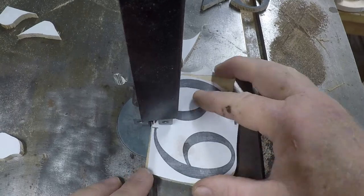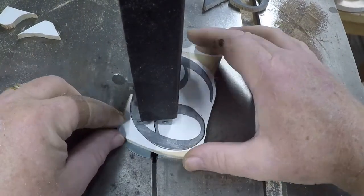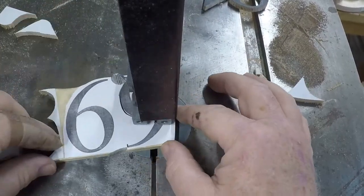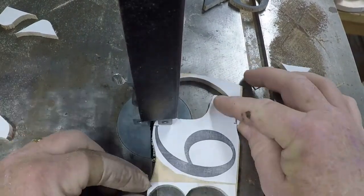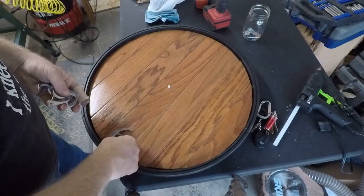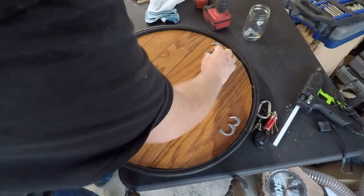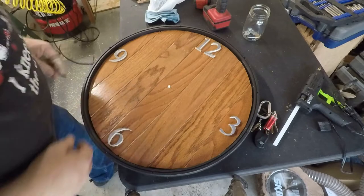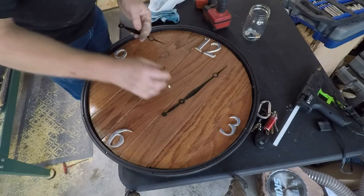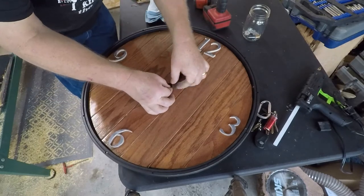As a matter of fact, I used to do this for a living — the letters and numbers were a lot bigger. I worked for a sign shop, and that's where, many years ago, I started using a bandsaw, really cutting letters every day. So I got all the numbers cut out, they still have the paper on top of them. I drilled a hole in the center and put the movement behind it. I did have to recess the wood a little bit — the center shaft wasn't quite long enough to go through everything, so I took it down just a little bit with a belt sander and it turned out fine.